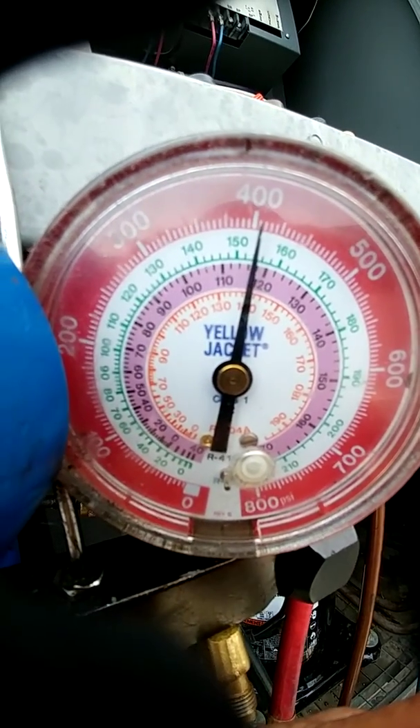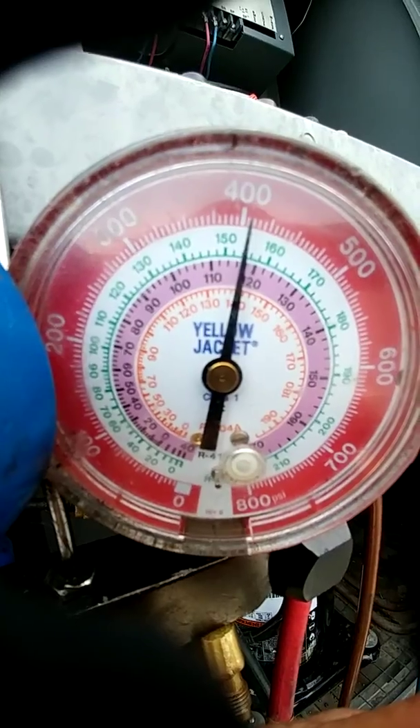See it? Just ticking. That's how you know you have non-condensibles in your system — right there, hands down, that is the best way to diagnose it. You guys have an awesome day. We're back Saturday and I'll give you an update on this one. Like, subscribe. Rock on.